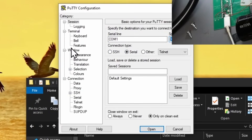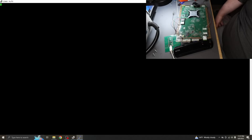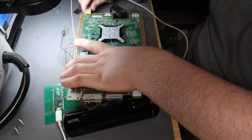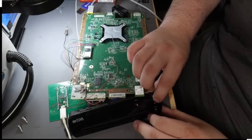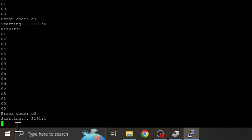Let's go to serial. We're going to change the speed to 115200 and change this to COM 5. When we plug in the Wii U, any insane amount of luck should work — it should sometimes automatically start. We have to hit the power button. Amazing — it's glitching. When we see stuff like this happening, it means it is working.